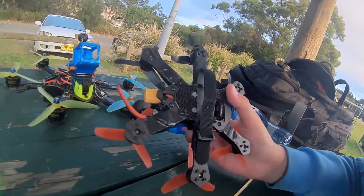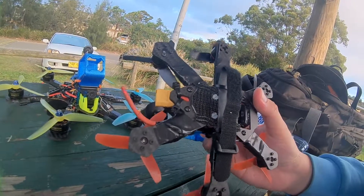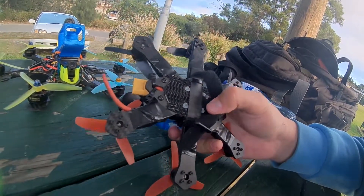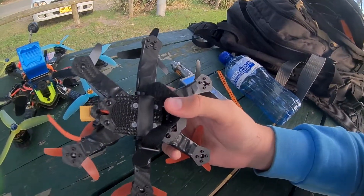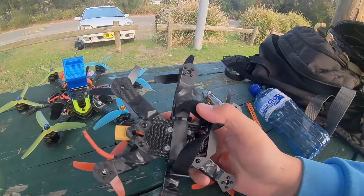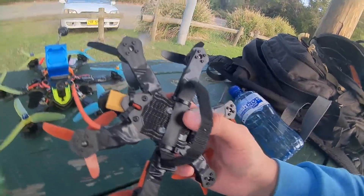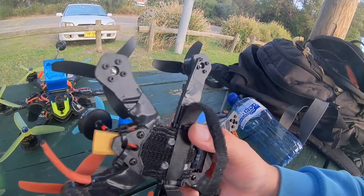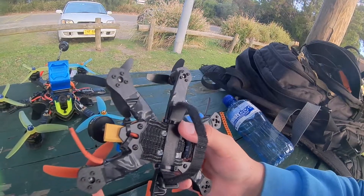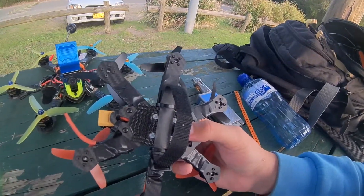That's my 3-inch build, just a few other little details. I run all 4 motor screws for each motor — I don't really like the idea of using just 2. I use dual lock for mounting my battery and I've come up with this unique system for hexacopters: you zip tie your battery strap around arms 5 and 6, which allows you to get a good cinch down. It also tends to break fewer battery straps because you're not wrapping around carbon fiber, and the zip ties have a little bit of give — so it's a really robust system with enough give to be strong and enough strength to keep your battery in when you cartwheel at 100kph.